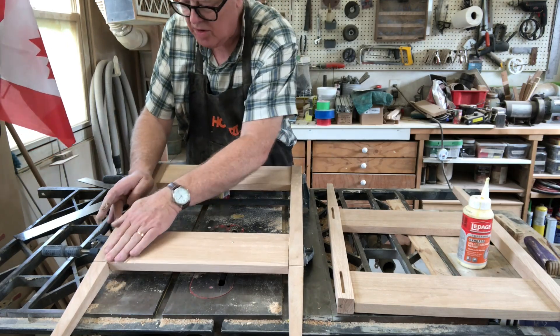So without further ado, I'm going to mount a drawer slide. There's our first drawer mounted. These slides are a little sticky though, so I'm going to need to do a little bit of adjusting. It is sitting a little low, so I'm going to adjust that as well. The first one is always the hardest — trying to figure out that little template. I'll raise that up a little bit — just about an eighth of an inch is all it needs. Side to side I'm happy with that result, and it's reasonably flush. Overall, yeah, I'm pleased. So that's it for today. Thank you very much for watching. Please like and subscribe, and I'll see you on the next video.